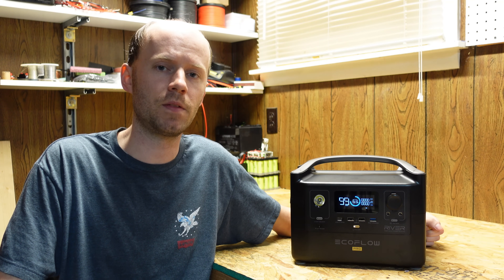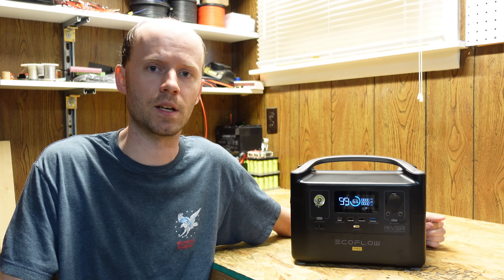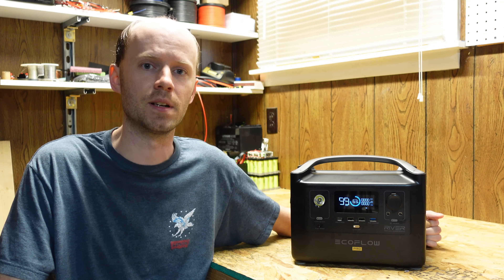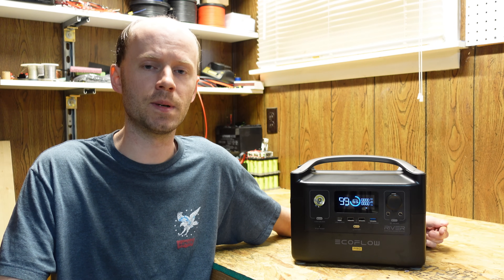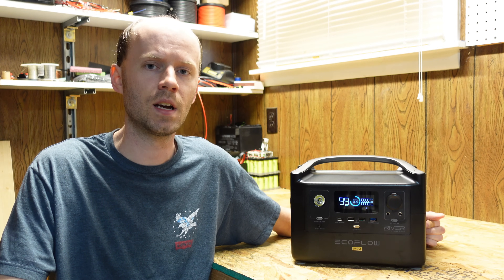I did want to do a teardown as part of this video, but at 11 minutes I think I'll save that for a separate video so it's not rushed. Overall, I really like this portable power station and don't have any major complaints. The X-Boost function is a little bit weird, though I can see it being useful for resistive appliances such as incandescent light bulbs, toasters, and coffee makers. I really wish they had included a slightly larger inverter. The capacity test came in at 560 watt-hours pulled from the AC receptacle out of a 720 watt-hour battery, which works out to 78% of rated capacity.